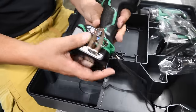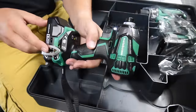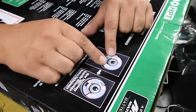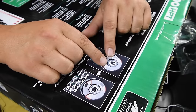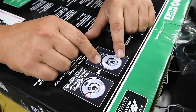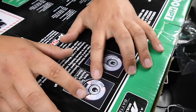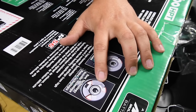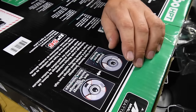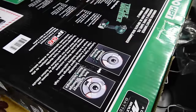The speed selector is on the side. This is a triple hammer anvil for the impact driver. The old design has two arms on the anvil and two points of contact on the hammer. This new one has three points of contact on the hammer and three arms on the anvil. It'll be interesting to test against other brands that only have a standard hammer and anvil.